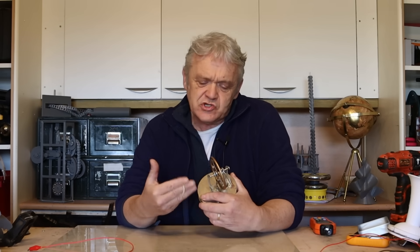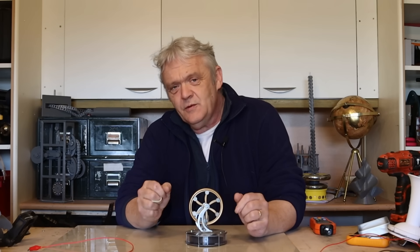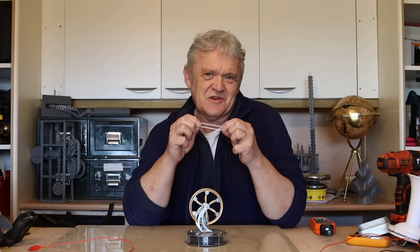The gas — in this case air — is a working fluid. The engine itself is just an arrangement of capturing that work in the working fluid and changing it into something that's much easier to use, in our case mechanical work. But a working fluid doesn't have to be a gas. Gas has lots of problems — one thing is it leaks. A working fluid can use a fluid like oil and water, but it can also use a solid, like this rubber.